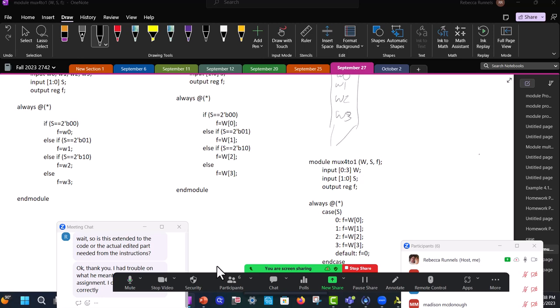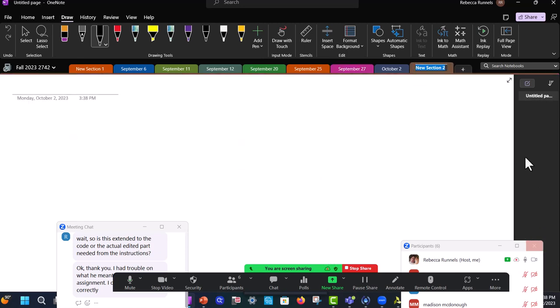And so I want that to be computing whether or not I'm at the positive edge of the clock. I have all of these things going on to figure out what my next state is going to be, and I want it to be ready when the clock changes, to be ready to load the next state. So when I am doing my first always block, always at X, Y, whenever any of those things change, and then maybe I have a case statement, so I'll have begin. I might not need a begin if all I have is a single case statement.